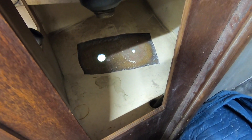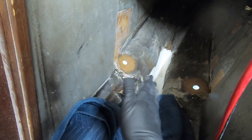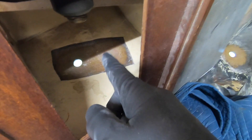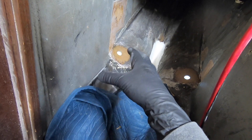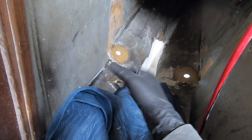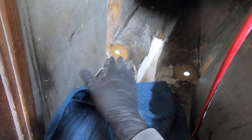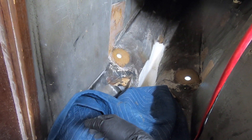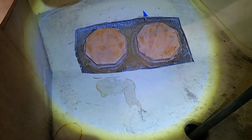I did that for the starboard side as well. For in here I can measure it out from outside pretty easily. These ones are on a bit of a curve on the hull — much more than these which are pretty flat. I can rock it back and forth, all the way one way or the other, but when I put the through hole in I want to make sure the outside flat surface and the top of the backing plate flat surface are as parallel as possible. Got these two in — taped them to keep them from sliding down the hull — and they're cured.